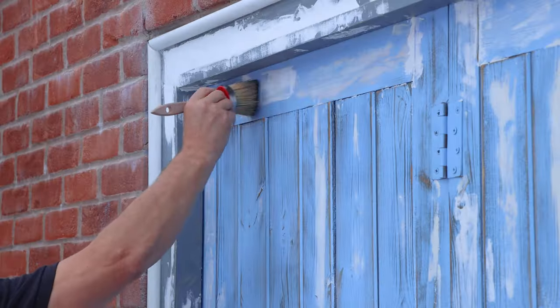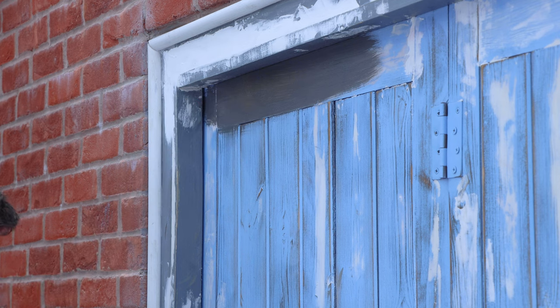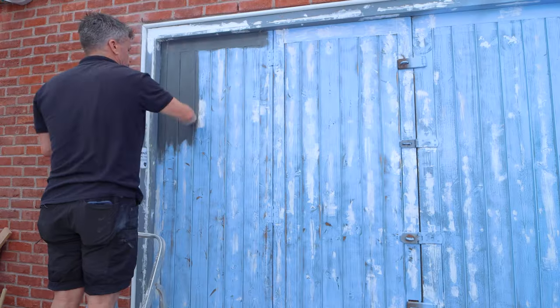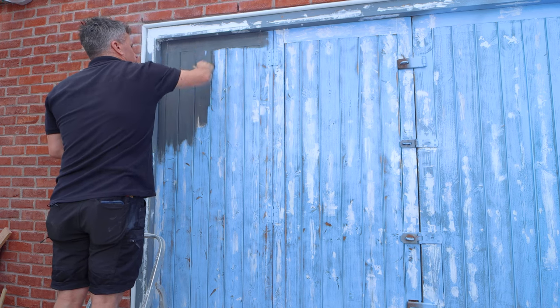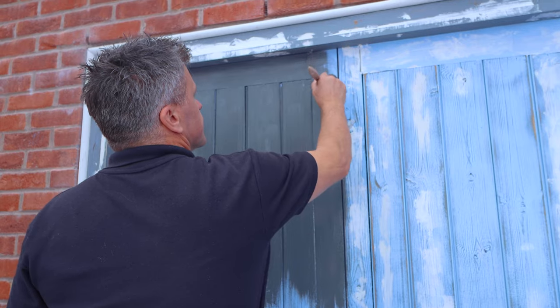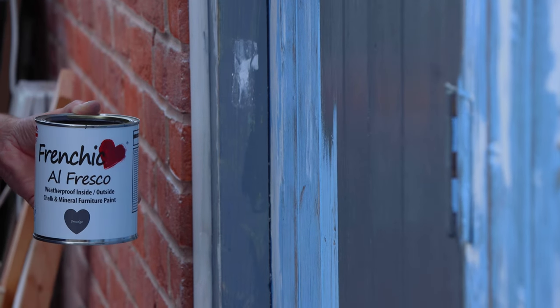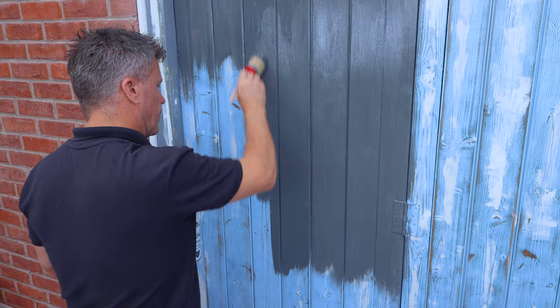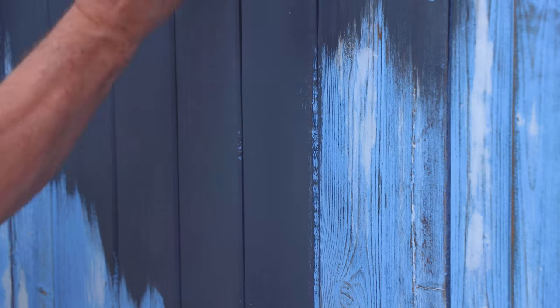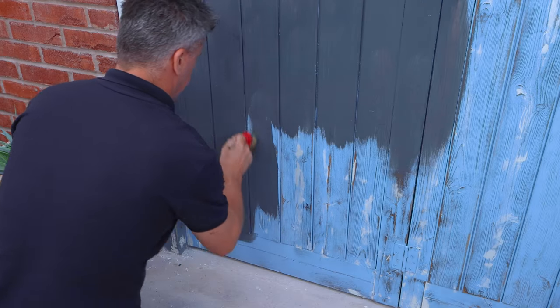Now it's dry, I'm ready to apply my first coat of paint using my trusty paintbrush. I'm going to start by cutting in around the top frame of the door itself, and as always we'd advise painting with the grain. The style of these old wooden doors is a smoothly planed tongue-and-groove panel, clamped together with an outer frame holding them in position, so painting them can be quite tricky — you've got lots of V-grooves between each slat. Make sure you get tight in between these the best you can, and continue to apply your paint in an up-and-down motion going with the grain. For deep, awkward crevices between the grooves, stab the edge of the brush in there, then feather over the top to help get a smoother finish on the surface.